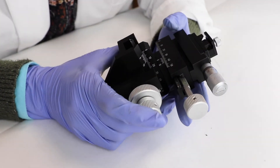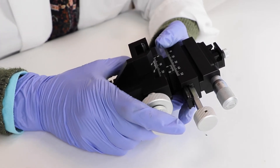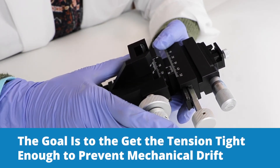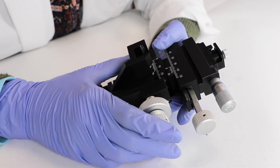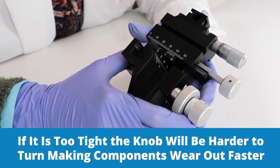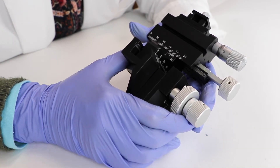You're going to do the same thing with the y-axis. If the x-axis feels too tight or too loose, unscrew it and do it again. Typically, the goal is to get the tension just tight enough to prevent the axis from drifting under its own weight while it's not loaded, but not any tighter than necessary. The correct amount of tension often occurs within a narrow range of adjustment. If you make it too tight, the knob will be harder to turn and the frictional component will wear out faster, so be patient and do it a couple times.